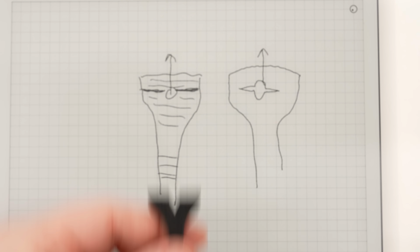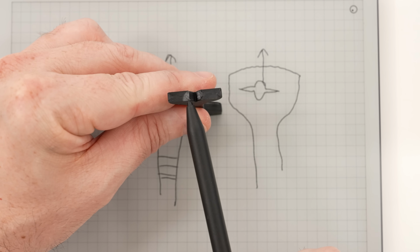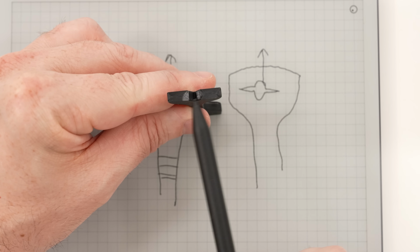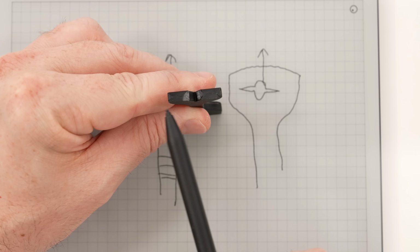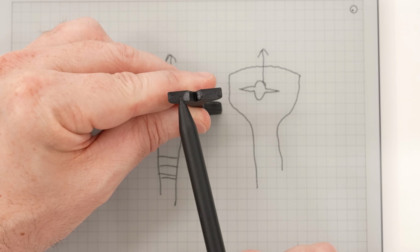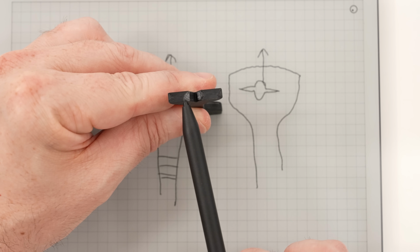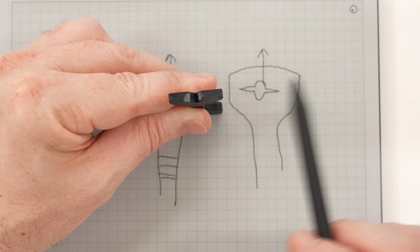And you can kind of see that in the cross-section of this part as well. You can see the stressed plastic right here next to the hole. It finally started shooting out in this direction, and then the whole thing just fractured along the layer line. There wasn't time for this plastic to be pulled and stretched. There may be some marks on the other half of this if I went and found it, but the shattering just happened suddenly and just ripped off both sides.